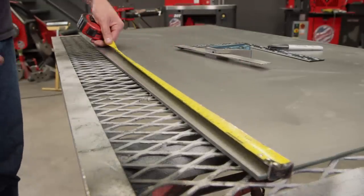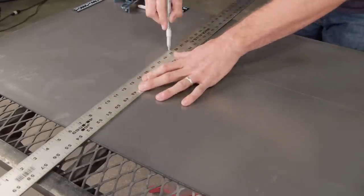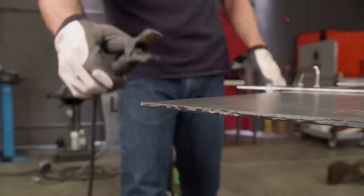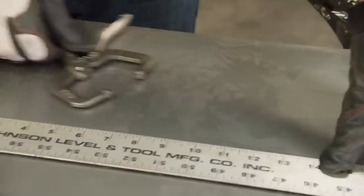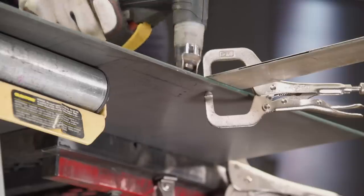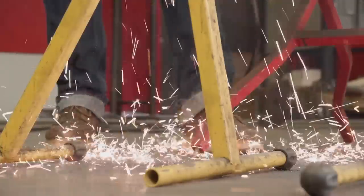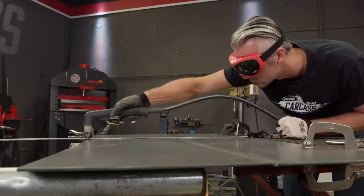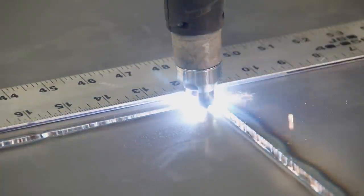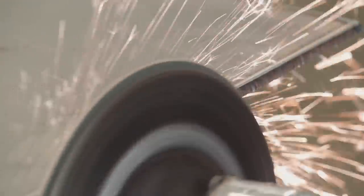We're replacing 30 inches before we transition to the rectangular tubing. We'll connect the dots, giving us a cutting line to follow with the plasma torch. We're going to use a straight edge to help guide us along this cut — line the tip of our torch up with our cut line and just clamp the straight edge in place. Butting our torch up against the edge of our yardstick, we can begin cutting. After our first cut, we'll reset the straight edge and finish the cut. We'll follow that up with a seven-inch grinder to clean up the jagged edges left behind by the plasma torch.